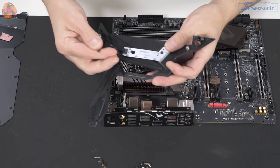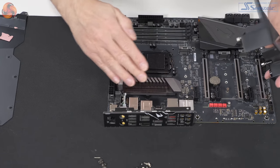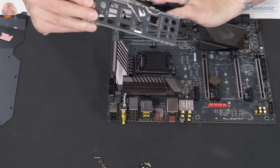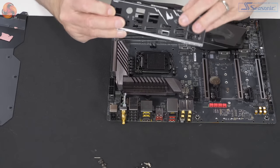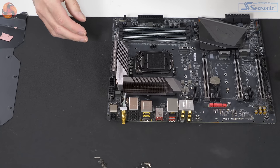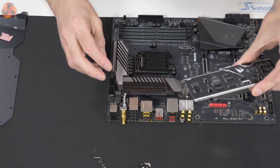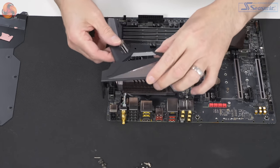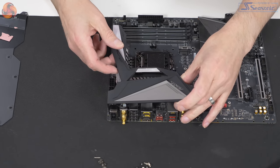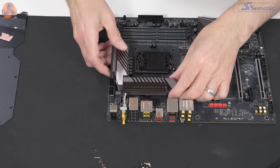We take off the shroud over the VRMs — you can see the connector for the lights. The shroud, in conjunction with the fixed IO shield, doesn't leave a lot of ability for air to flow over the heatsink in this section. We have seen some motherboards with tiny fans here, but some ventilation — perforating the plastic, or cutting it back — would be preferable. It's after all entirely cosmetic, and we'd much prefer having some airflow.